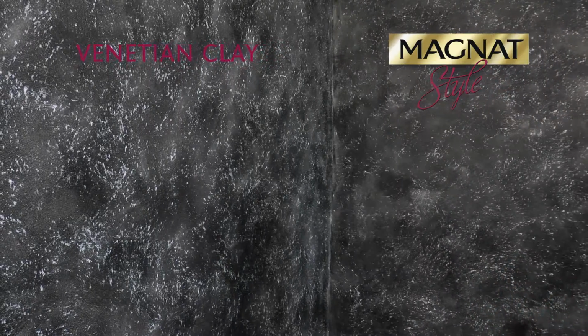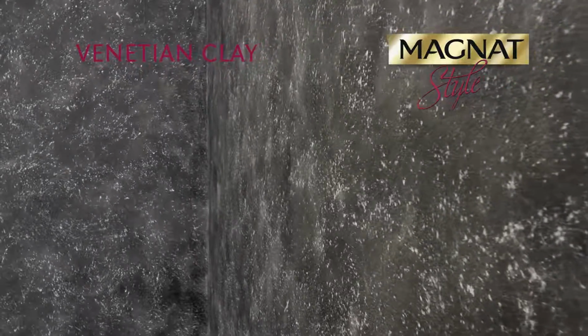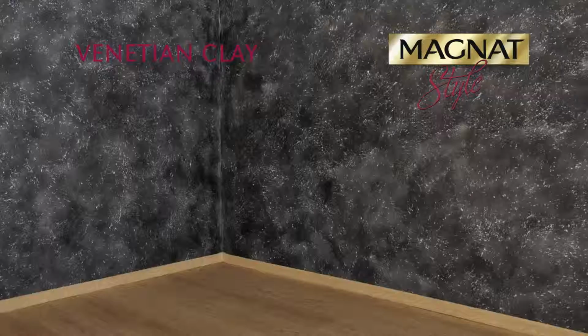The paint develops full strength with resistance to soiling in 28 days from its application. If the product is to be applied on surfaces extremely exposed to soiling, preserve it with MAGNAT Style Rustic Top Coat Sealer.